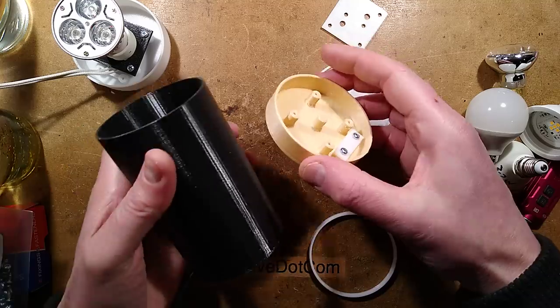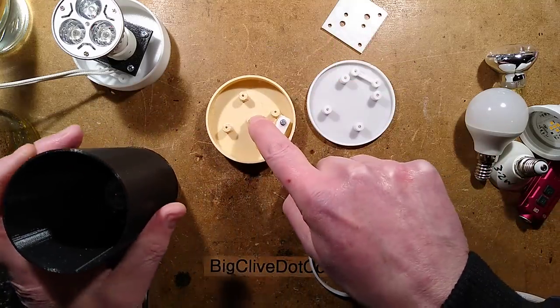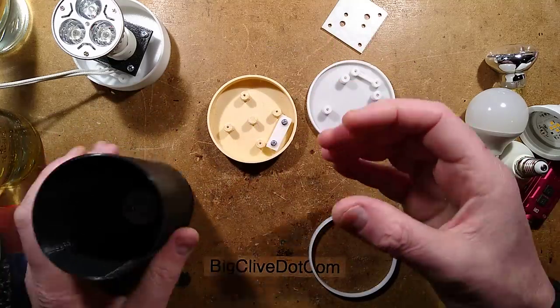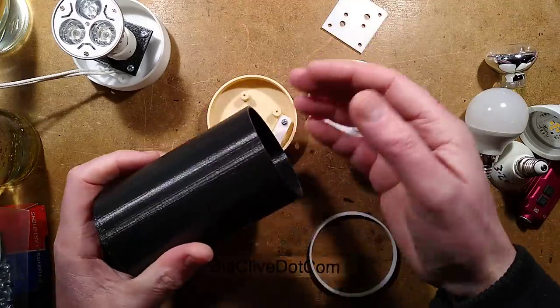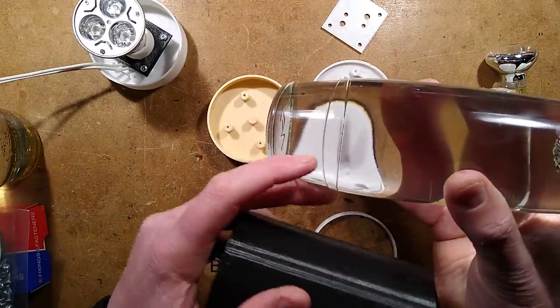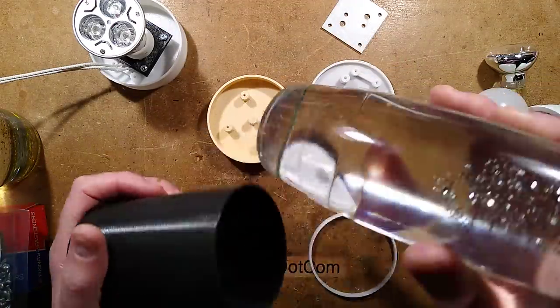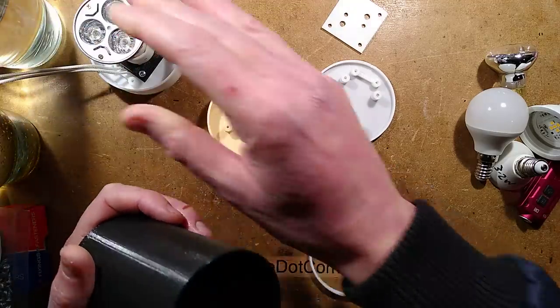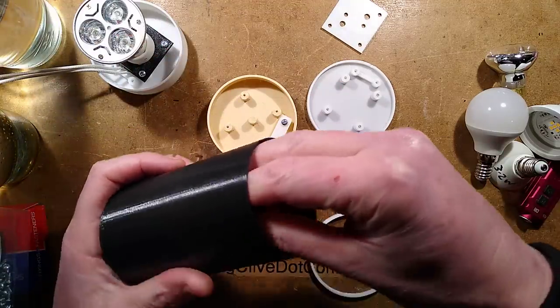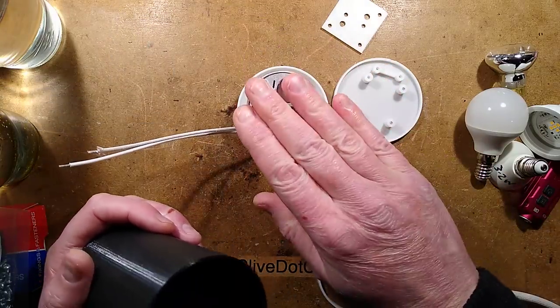The next file that you'll find down below is for this, which scales up to this. I've recently added an extra feature because I realized that if you're going to be making them from scratch, instead of this type of vial, which has this glass recess here that sits down into the base and then stops, other standard bottles, like say for instance a wine bottle, will slide all the way down and effectively rest on top of the LED lamp, which is good for thermal connection.